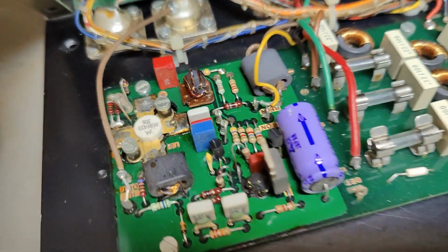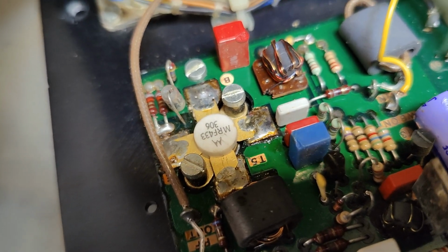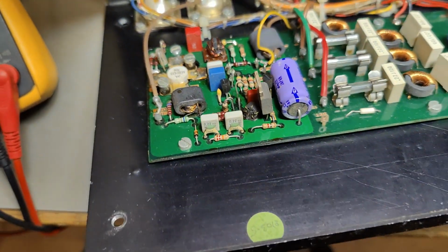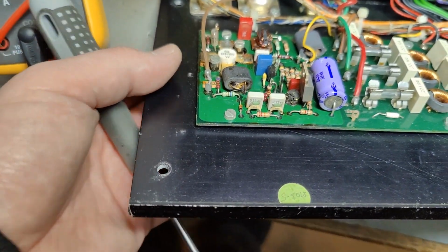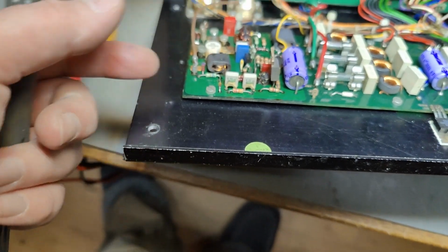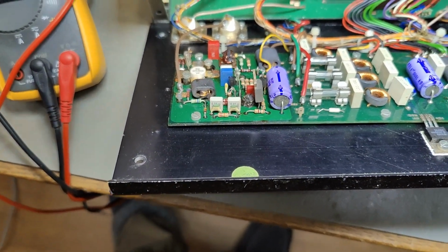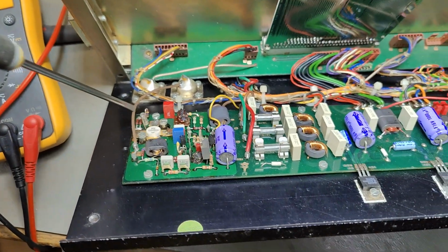This is the output stage, so there's a little pre-driver. But I mean, look at that one. That is a hefty driver. So this one is like 50 watts or something like that, right? But there isn't any heatsink here, or maybe somebody's removed the heatsink. So I probably shouldn't load it with that many watts. Also some pretty thin wires.